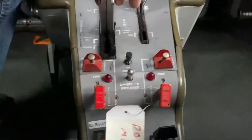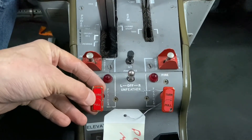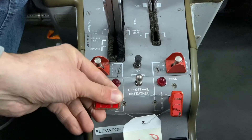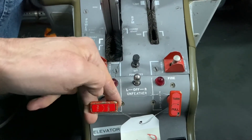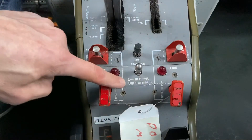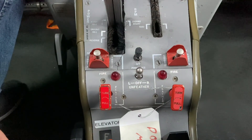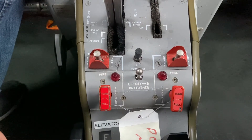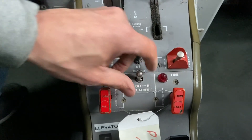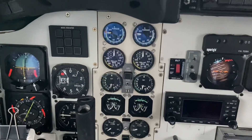The last part is feather. When the pilots have a problem with the engine and need to feather it, they're going to turn and pull on this lever. It's going to manually shut off the fuel with the manual shutoff valve first, and then pull in the feathering valve to feather the engine. This aircraft is also equipped with an unfeathering pump that will allow the propeller to unfeather if the start latches are missed during shutdown because the pilots didn't select reverse. If that occurs, the pilots would move the power lever into the reverse position, trigger the switch for whichever engine they're trying to unfeather, and once it's on the latches they can release it and then attempt a start.